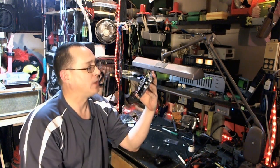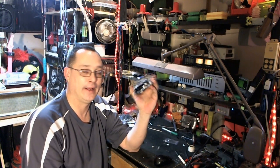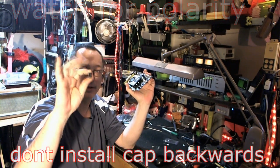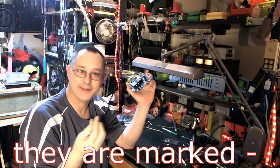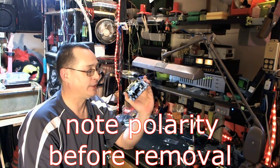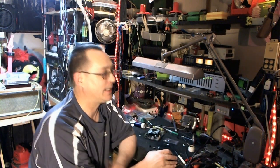About six months went by, and I went and purchased replacements off eBay — we'll see how those work out. Initially I put in a regular electrolytic capacitor, not a solid aluminum, and it worked fine. I had that cap in there for about a week, maybe a little more, but you really wouldn't want to chance it long-term. It calls for the low ESR solid aluminum. I did a little snooping around in the forums where guys are talking about it.